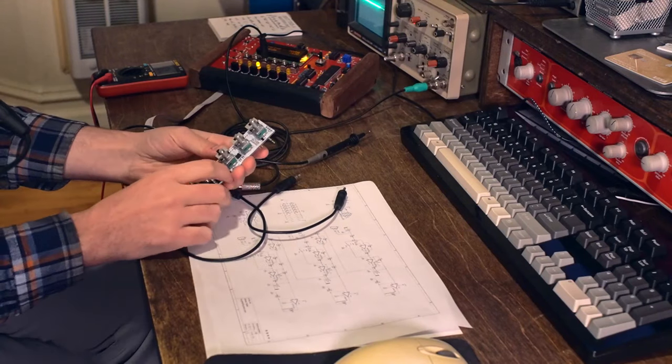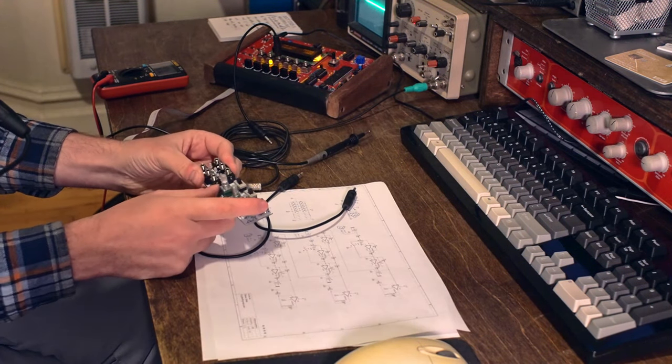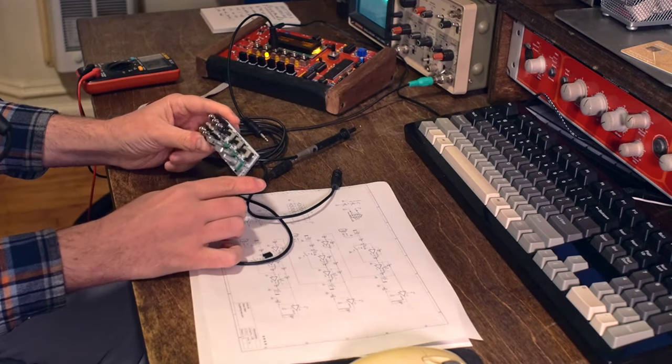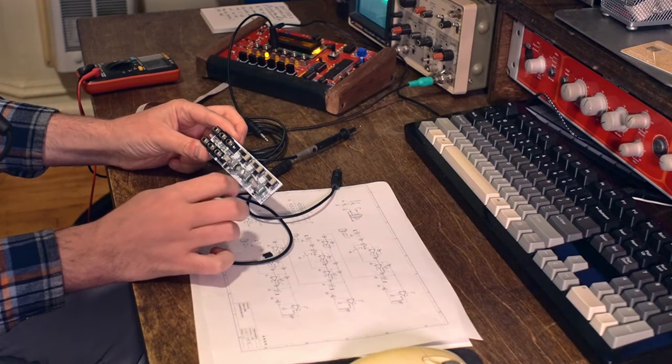All right, so I've been probing around this with the oscilloscope, the multimeter, and the module tester for a little while. I have noticed that it does output the correct voltages if this jumper is removed. So I'm going to get this under some bright light and look very closely at all of these joints and probably do some reflow work with the hot air and some solder paste.